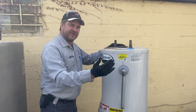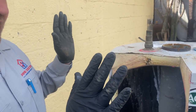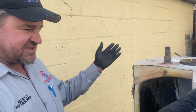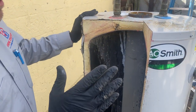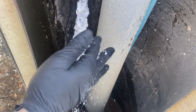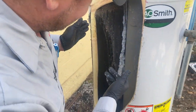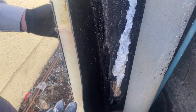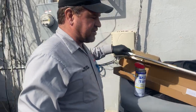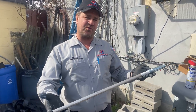Now let's talk about how to extend the life of this water heater. This is a water heater we did not modify — we only cut it open with a reciprocating saw. Take a look inside — this thing right here covered with all this calcium, crumbling apart. This is called the sacrificial anode rod. Over here I have a couple of anode rods for new water heaters. This is a magnesium anode rod that goes on a Rheem water heater and extends the life from six to ten years. Does this look like that? I don't think so.